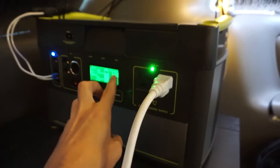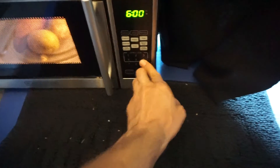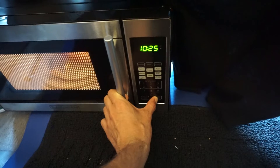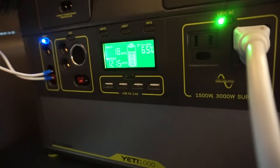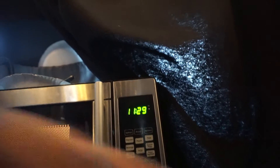We're going to do a load test. Right now the battery is at 66%. We're going to put a microwave on, a fan that's 100 watts, and a laptop charging at 120 watts. We'll do 12 minutes on the microwave. With the fan on, it says it's using around 1,200 watts. Let's put it on the microwave and see how long it lasts until it fails — or if it does fail.